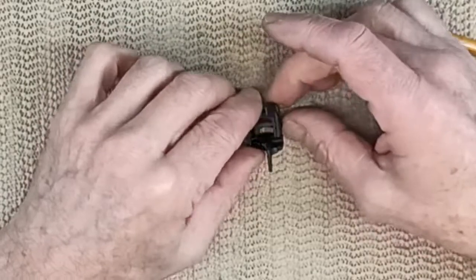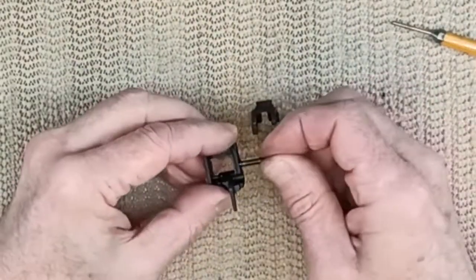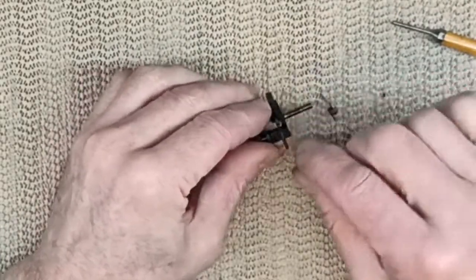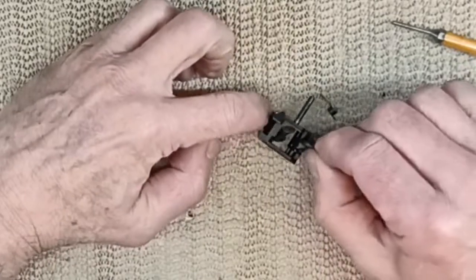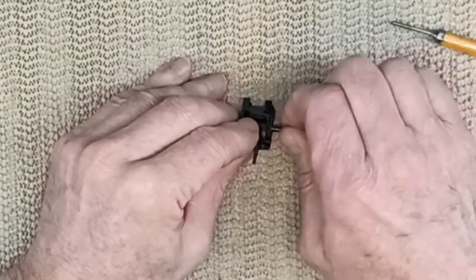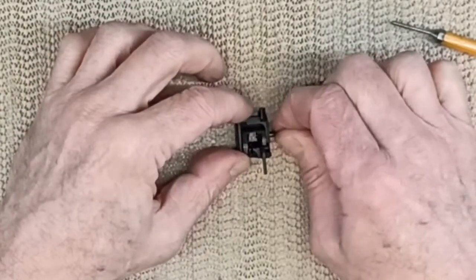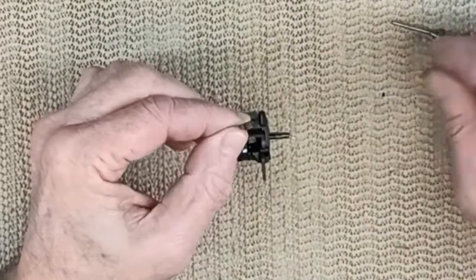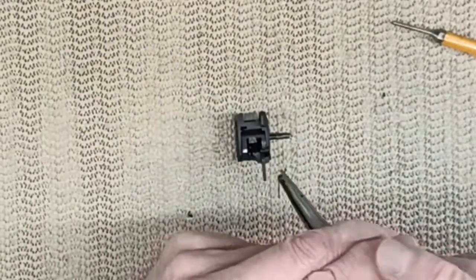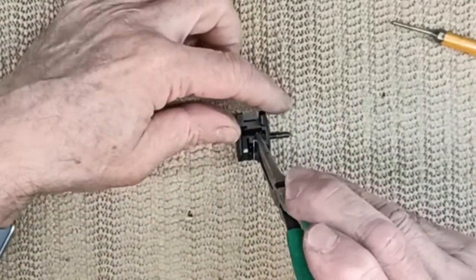And you are going to finish. No, let's start with this pin. I'm going to start it slightly. Then we move the sear into the, come on, baby. There you go. You want to ride the pin through the sear. Now, you don't want it to go past the sear, because you're going to insert that spring. So I'm going to take my pliers. That long string will go into the slot here, and the short one will be laid against the frame.